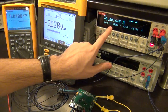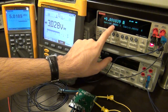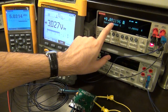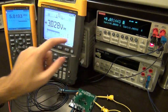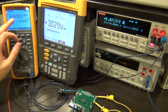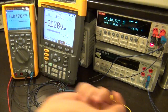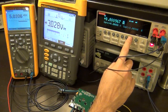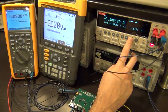There it is. By providing it with only 0.3 volts and taking something along the lines of a few milliamps, it is providing a constant 3 volts from the LDO and a constant 5 volts from the output. This is of course under no load at all. I can increase the voltage - 0.4, 0.5 volt - obviously nothing's going to happen because these are both supposed to stay constant.